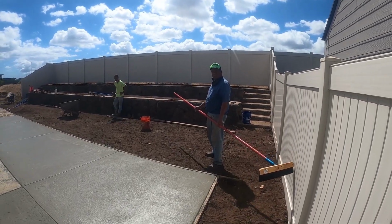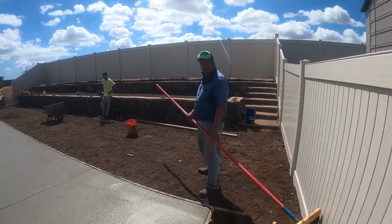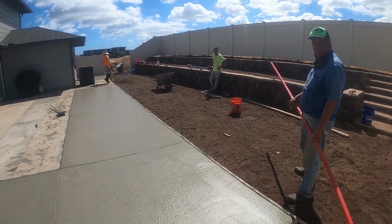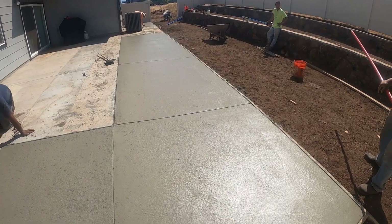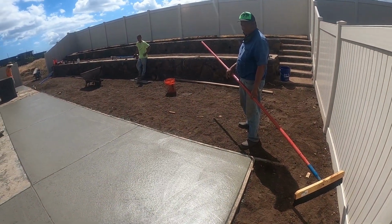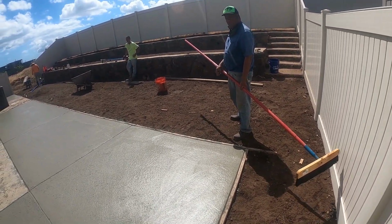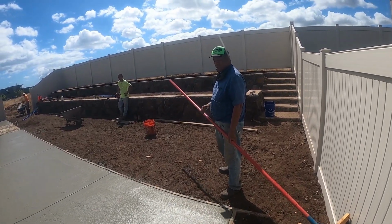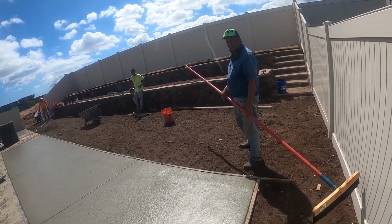Wonderful weather. We were here this afternoon to start this pour. Bobby and his crew prepped this yesterday. We set up here to pour the concrete. There's fiber inside the concrete, that's what holds the whole thing. Fiber is the tricky part of this. When we screeded, the dish was a little more than 4.5 inches, and we poured all the edge and straight edged, and now we trowel. It's a broom finish right now.